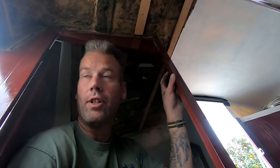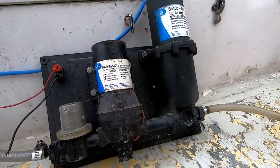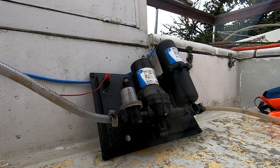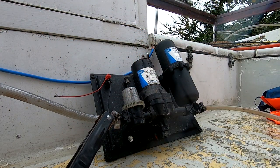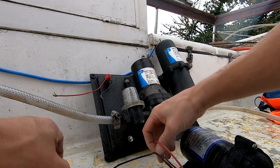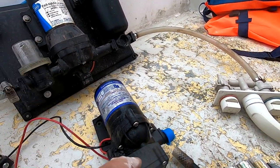I've got to look at the water system — I want a running tap on here. So I've got a tap on to check the pressure, because as I said yesterday I think the 20 psi thing isn't quite correct on here. It just keeps building and building and building, and it's really noisy. So I'm going to swap this pump out with one that was supplied with the boat. If I show you the noise difference — this is the existing pump, quite a noisy old beast. This is going to be the new replacement pump — that's a bit different. So I'm going to fit this onto there hopefully, as long as this is all interchangeable.